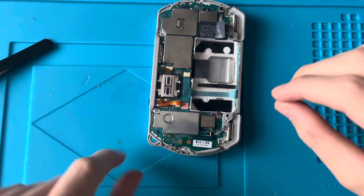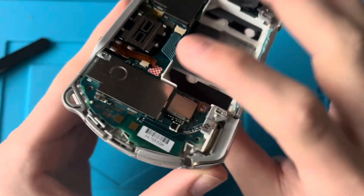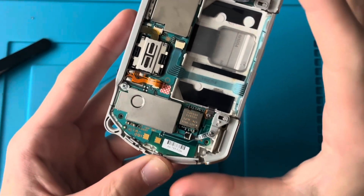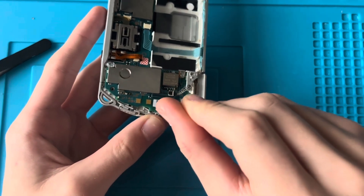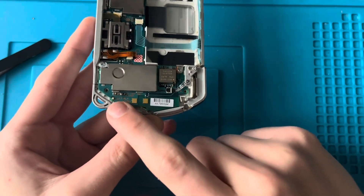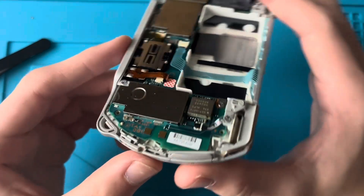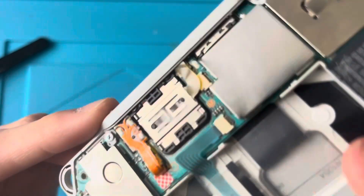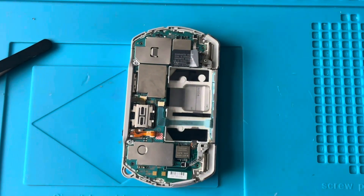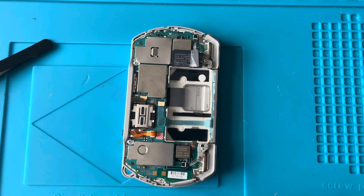It really isn't the neatest, but bearing in mind the scale I'm working at it's not too bad. The fuse is at an angle because I couldn't get my soldering iron in that little gap between the ceramic thing and the fuse, so I've just soldered the fuse to the side of the ceramic thing. I can't remember what it's called, but it's connected to where it needs to be - it should work. The fuse is not blown, and just to double check, my multimeter - there you go, hopefully you heard that.